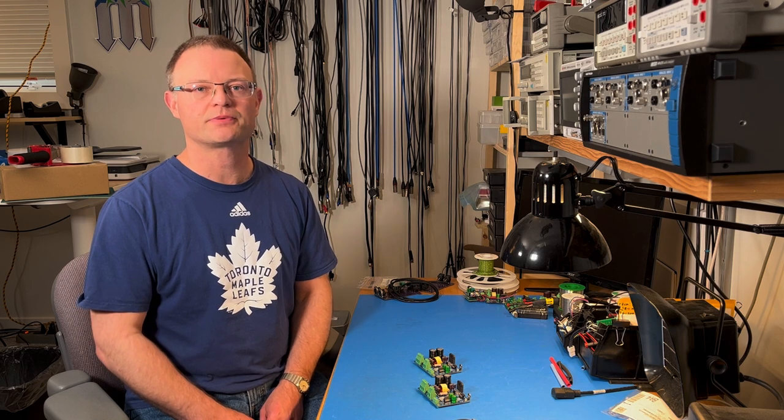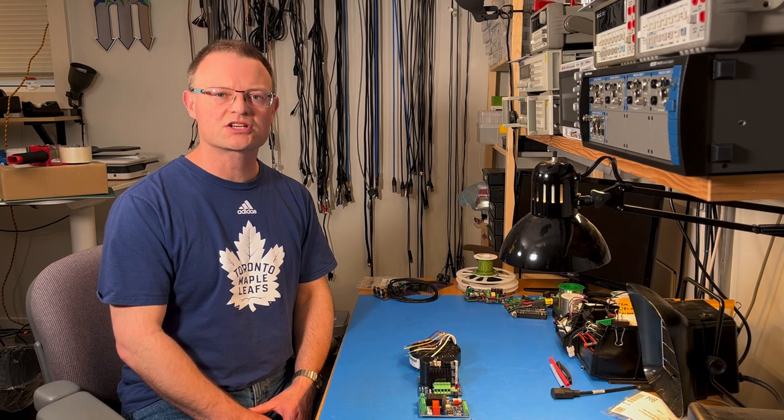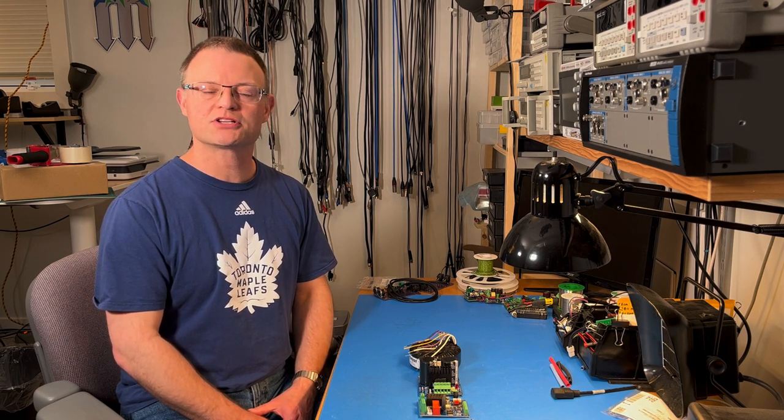The star of the show in this build video is the Modulus 86. In this amplifier, I used error correction to drive the distortion of an LM3886 chip amp way down below audible. This is why the Neurochrome Modulus 86 sounds as good as it does. It is completely transparent, and I back this claim up with many measurements on the Modulus 86 product page. Two Modulus 86 modules are shown here; they are available as a blank circuit board that you buy parts for and assemble yourself. For a video on how to do that, please see my channel. The Modulus 86 will provide 40 watts into 8 ohms and 65 watts into 4 ohms when powered by plus/minus 30 volts DC.